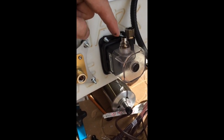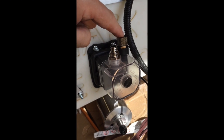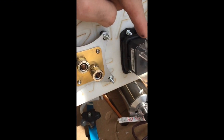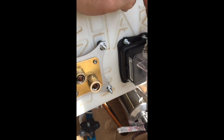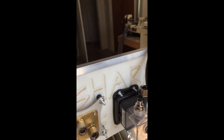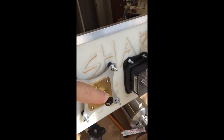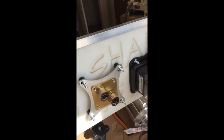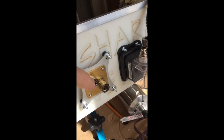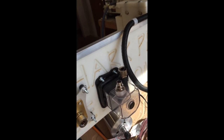There's a shield here that deflects flow. This is the input port and this is the output port. The input port should come from the radiator cooler — cool fluid comes into the pump, gets pressurized, goes out of the pump and to the spindle motor, then comes back from the spindle motor and goes back to the radiator cooler. So there's one hose from the pump to the radiator, one hose from the pump to the spindle, and one hose from the spindle back to the cooler.